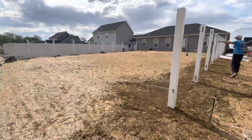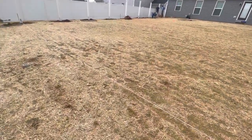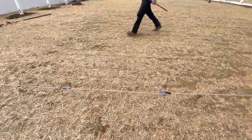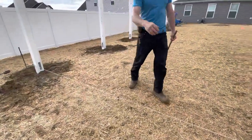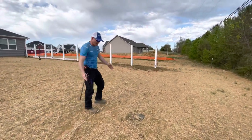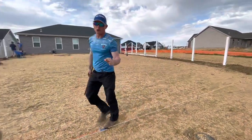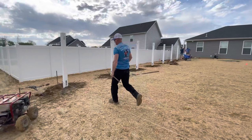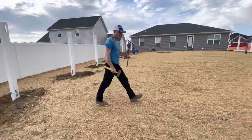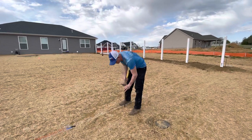So we can see that the sewer line comes right up into the house. And now I can tell right now I have a post here and a post here, and I'm straddling that sewer line — that's what we're looking for. We're going to go for a mid-stake. I'm going to put this mid-stake in here; it's not going to be in the way of me digging holes.